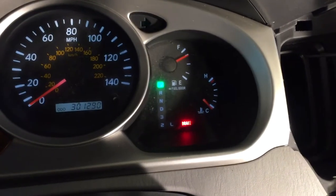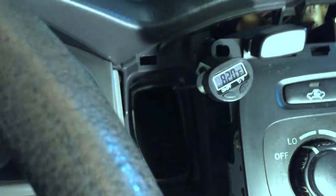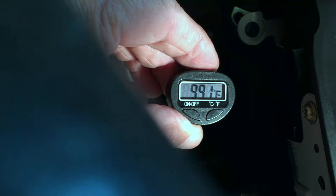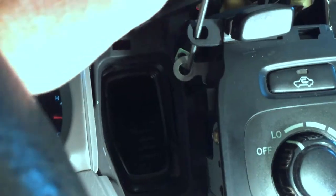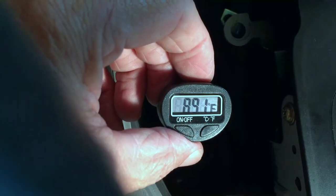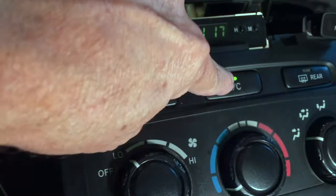The engine cooled off so I have to wait for it to heat up. Ten minutes later the engine is warmed up - it's 82 degrees. It's set to heat. Cut it on and hopefully the heat will come on right away - and it did. See we're going up quick. The heater is working - already up to 112. Switching over to AC to make sure the air conditioner works - I just heard the compressor kick on. You can see the temperature dropping. It appears that my solder job, even though it was god-awful ugly, appears to have worked.